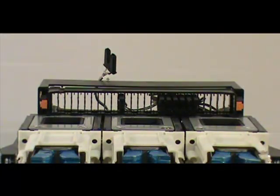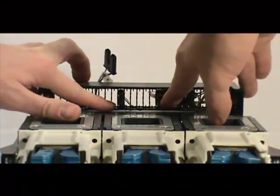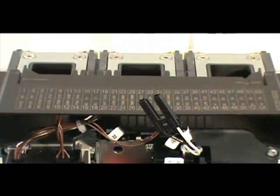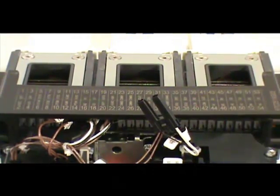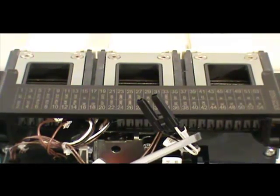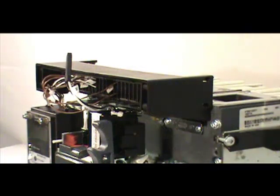The last step is to connect the secondary leads. To simplify the process, release the secondary tray by pressing on the 2 orange tabs on the back of the tray. Slide the tray until the back edge of the tray lines up with the numbers. The spring release's leads should connect to positions 35 and 36 in the secondary mounting bracket. When inserting the leads, odd numbers are always on the bottom.